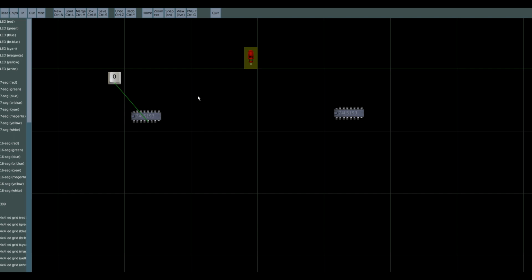And then if we look at the output of one of the LEDs, so let's go to pin out across here. Let's have a look. What have we got? No, not the carry. Carry is going to go across to the other circuit. That's the borrow. Clear. Okay, let's go down the bottom. QD, QC, QA. Okay, so QA, take that up. QA is our first bit.